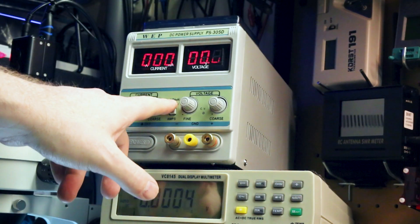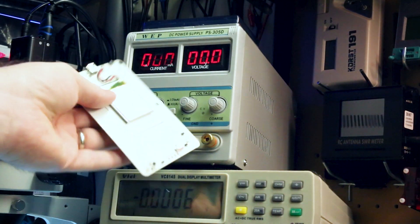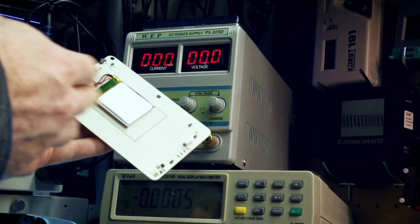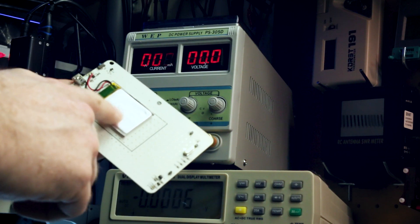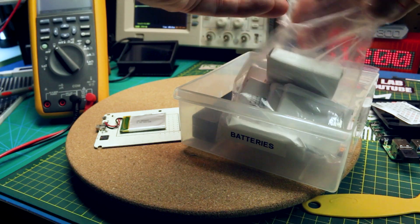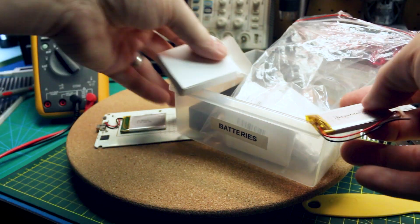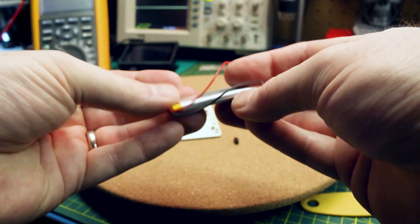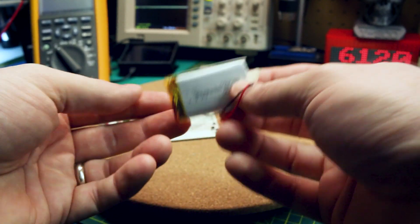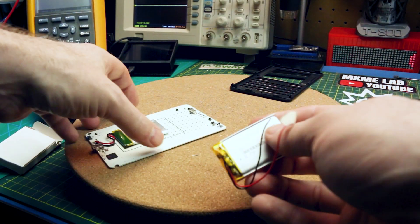If you're lucky enough to have a bench power supply that can feed 3.7 volts, you can give the battery a little kick start and it'll likely start charging and everything will be fine, as long as the battery is not swollen. But since we know it's the battery, we can just move forward to changing it. I'll put links below to suitable batteries. As long as you get a 3.7 volt single cell battery you're good to go. This is a 900 milliamp unit — tons of capacity and it'll work just fine.